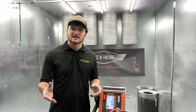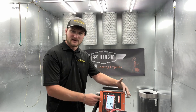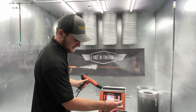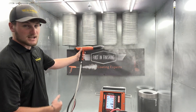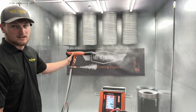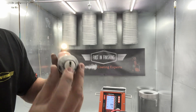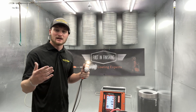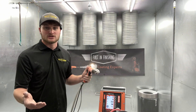Now for our last setting: the rinsing air. It's on your second page — hit this book icon and it's the top number. Point two (0.2) is the factory setting. You can turn it up or down — at a lower setting there's less pressure behind it, and if you go really high like 1.0 it pushes very hard. However, the rinsing air comes out of the electrode, so the middle of your cloud will have more air than the rest, which you don't want. I recommend 0.2 or lower. If you're doing metallics and putting a really big load on the cascade, you might increase it to help keep it cool, but most of the time 0.2 or 0.1 is fine.